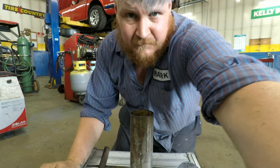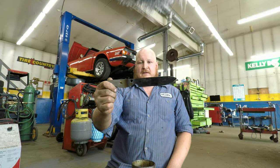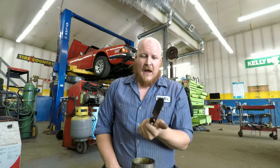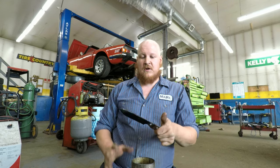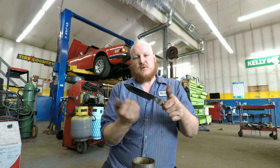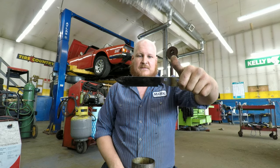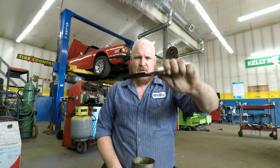So now the next step is we'll be heading back to the house and we'll be tempering this. Now, what tempering does — because right now yes it's nice and hard, but it's a little bit too hard. What you're going to run the risk of if you keep it too hard is it being brittle, so when you go and chop at things it might just crack. So by tempering it, you remove some of the hardness but not too much of it. And it just makes a knife that's going to be able to hold an edge and also take a beating.